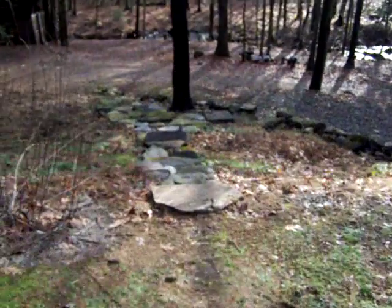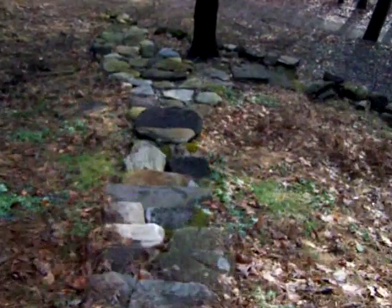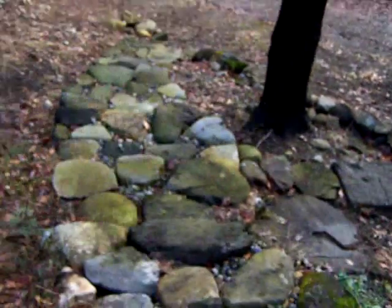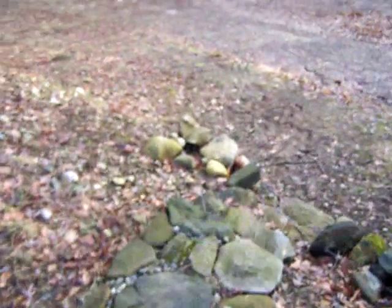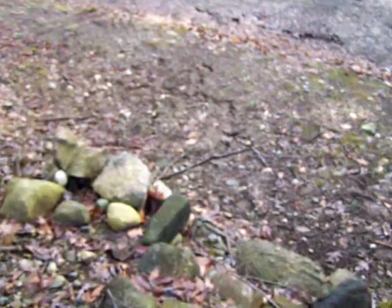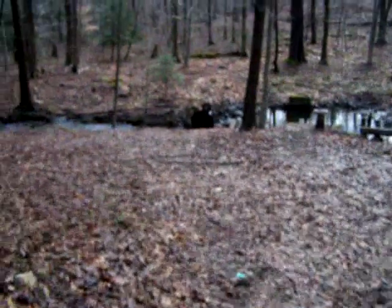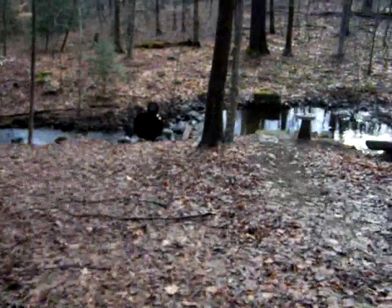I'll take a little walk down to the little stream I've got here and show you the micro hydro. You may have seen some of my other videos — I used to have this set up built onto a bicycle frame, but I refabricated it onto a trailer hub, which is a little more rugged. The old bicycle frame setup worked pretty good, but it wasn't very rugged, so the bearings would wear out in about half a year.